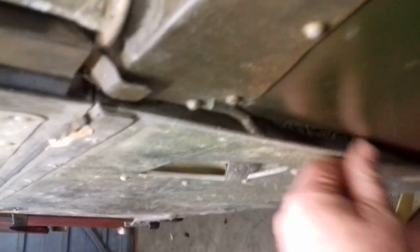I'm not sure what I'm going to do about it at the moment so let's have a quick look. That's the sort of fitting I've got at the moment. Down here I'll be able to adjust the lock a little bit, or the catch. I think this top bit is not too bad. But the problem I've got is that's the middle hinge I've had to take off, because the top one and the bottom one just slots straight in. But the middle one you have to bend the door open right back on itself to get it in. So I can play around with that later.